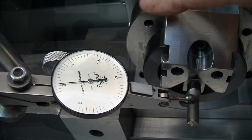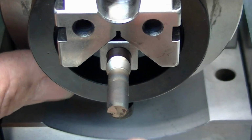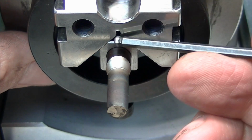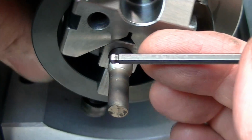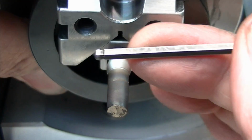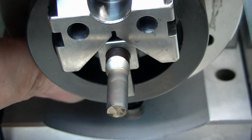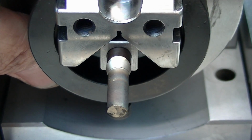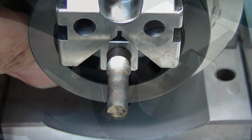Plenty close enough. Remember, I said this would be facing the other way. We'd be working on the back side of the punch grinder. But we know we would touch here, because we know from the drawing that we're taking exactly 100 thousandths radially from here to here. So here we can just come on here, 0 on that top, and then just plunge down, taking 100 thousandths off, move over with the wheel, plunge down. Okay, come back and just do a traverse pass, and we're good. Take this part out, stick each one in, do that every operation to all 6 of them, and we're good to go. And we've done the radii.